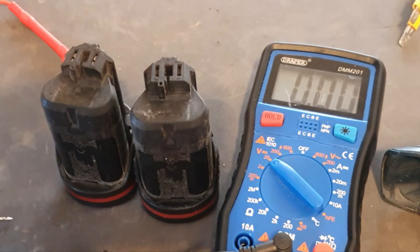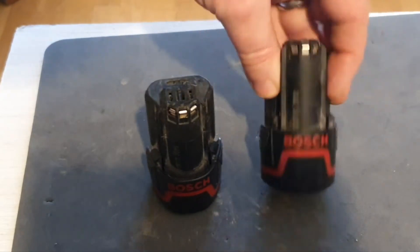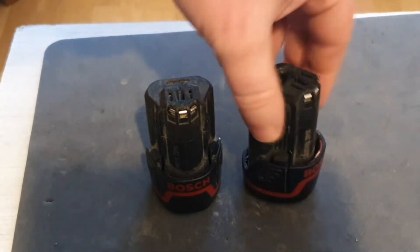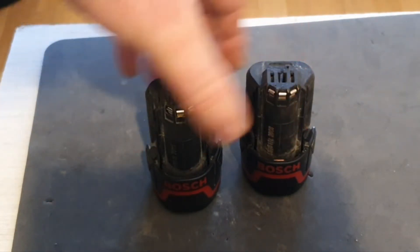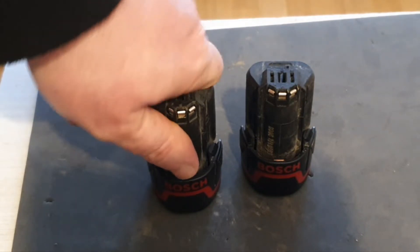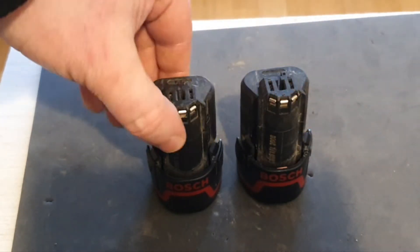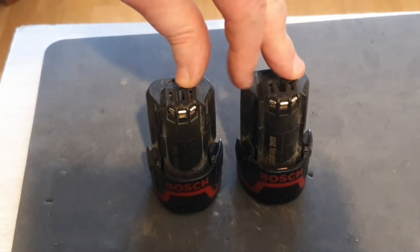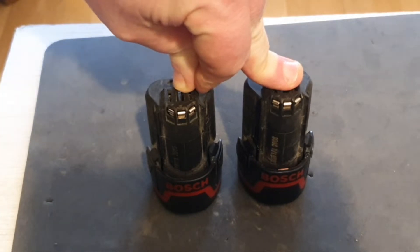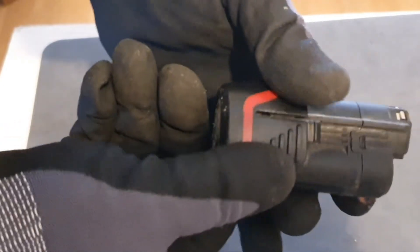So there's nothing wrong with the voltage in them. These little Bosch batteries have what I consider to be a very good workable voltage. The only thing I can do to make them better is to swap out the cells. There are three 18650 cells in each of these, and both are one ampere batteries. If I swap the cells out for higher capacity 18650s - something like 1.5, 2, or 2.5 ampere - it will significantly help power the screw gun better and drive faster.